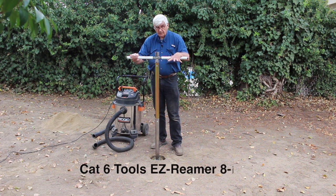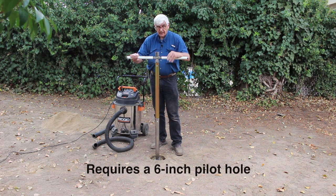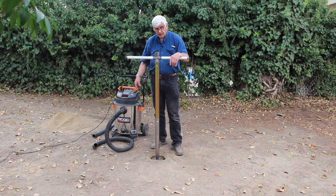The first thing I'm going to do is ream this hole with a reamer. When the reamer gets down to the point where we start to hit the dirt — the cuttings that are falling into the hole — then what I'm going to do is stick the vacuum hose on and we'll be sucking the dirt out as we're going down further.